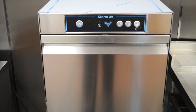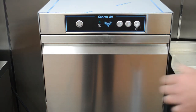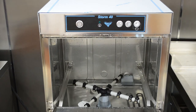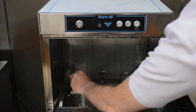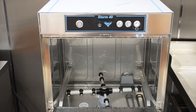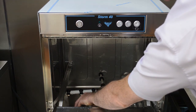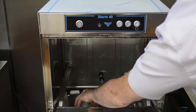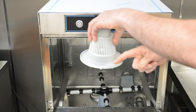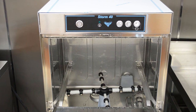At the end of the session — usually just after your lunchtime period or at the end of the day when you're ready to shut down — switch the machine off by pressing and holding the on/off switch until the light goes out. On the gravity drain versions, open the door and pull the drain plug out, which is situated at the front left-hand side. The machine will then fully drain away and the filter will trap any debris caught in the machine. Only when the machine is fully drained should you remove the filter. Twist it slightly to the left to disengage it and lift it out — any dirt will be contained in the small lip on the bottom of the filter. Remove the filter, tap it out over a drain, and then rinse it clean.